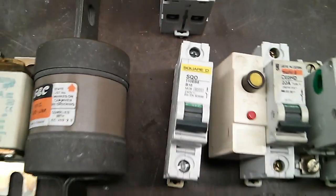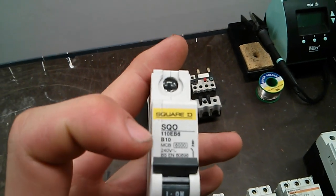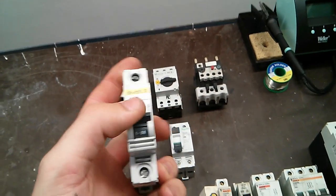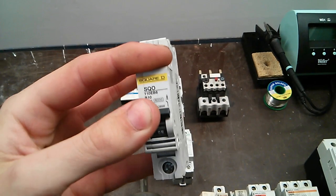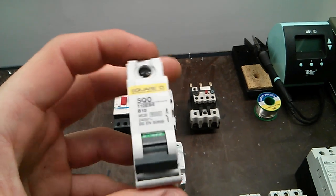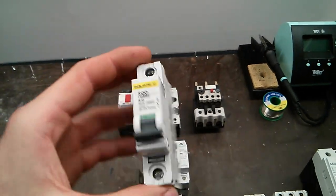Moving on, we've got miniature circuit breakers — these are the ones that we use in this country. They've got an off position and on position. If it goes above 10 amps for so many seconds, depending on the load, it'll trip off. If you hold it on and it does go over the amperage, it will actually trip inside and the lever won't make any difference — so you can't actually hold these on. They've changed that design since the first ones, which you could push up to the door and wedge so they wouldn't trip off — a fairly rough way of doing it. That's the Square D one — a B10 amp MCB. These are the very standard ones you find in all distribution boards in houses, factories, offices, practically everywhere.